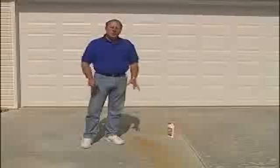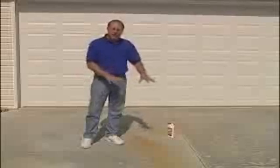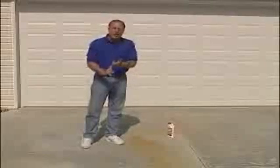This driveway right here, as you can see, was not sealed properly. Moisture got into the surface. In the winter, it froze, expanded, and actually popped the surface of this concrete off. Now, if you want to protect your entire driveway from this happening, put a good masonry sealer on there. That'll keep the water out, and you won't have to worry about the freezing.